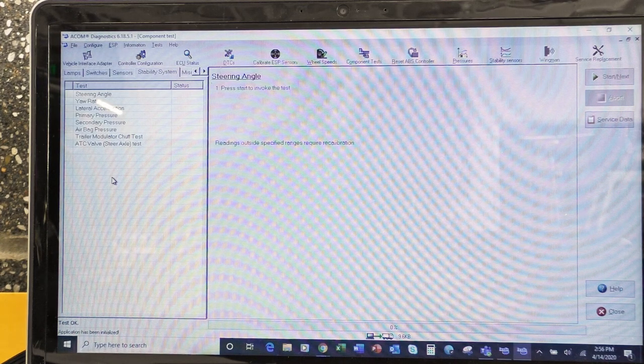This is all done through the ECM. All you're doing is maybe panicking a little bit, but electronic stability control will take over control of the brakes and possibly the transmission if it's an automatic, possibly decelerating the engine, etc. Okay, lateral acceleration, that would be if we are dynamiting the brakes or hitting the brakes too hard, then the lateral acceleration is going to take effect and will send information to the ECU.